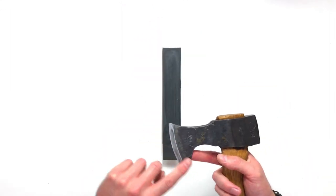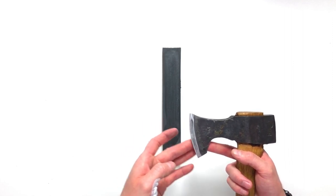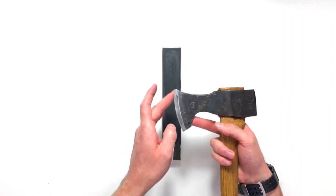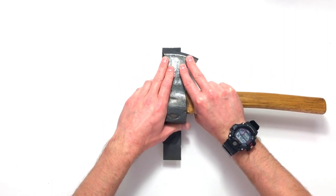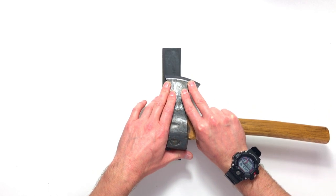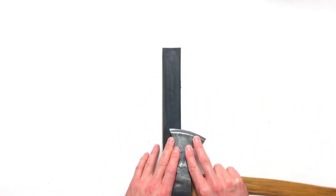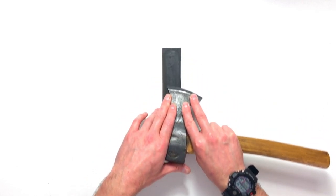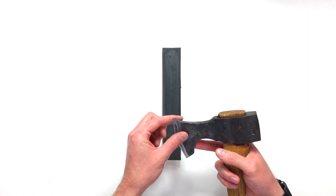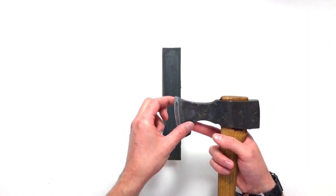So now we've done that we're going to make sure that we've raised a burr. I've got a slight burr in here but there's not a burr at the top so I'm going to go a little bit more up there. Find that bevel and the cutting edge. This edge isn't bad — I can start on 1200 especially as I've got that flat over hollow grind, but if you didn't you might want to go to a coarser grit. Now I can feel that burr all the way along underneath, so all I need to do is flip over and do the other side.